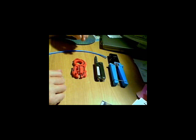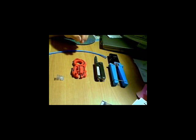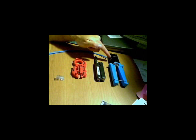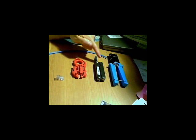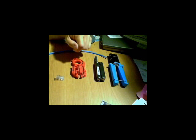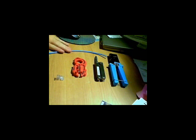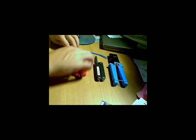So here we're going to do a demo of how to do one of these wonderful Cat5 RJ45 EZ terminations. Making sure you've got all your tools: your On-Q EZ RJ45 crimper — it is a special crimper that very few other guys make and it does some special stuff. Make sure you've got your snips; in my case I'm just going to use a nice little multi-tool. And then you've got your Cat5 specific stripper and a piece of Cat5 RJ45 EZ type crimp connection.